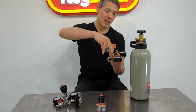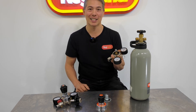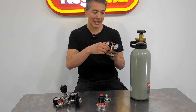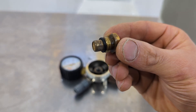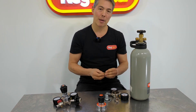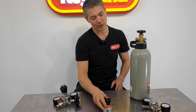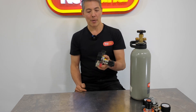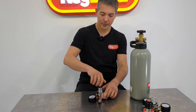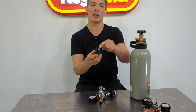You would take the bonnet assembly off like that. This is actually one that has been returned to us — the customer said 'my regulator's not working' — and funnily enough, you open it up and there's corrosion everywhere because liquid got inside. This is unfortunately quite common. Many people don't use check valves. You can see the whole seat and seat cap assembly has quite a lot of corrosion on it. That corrosion caused a pressure creep scenario. With the new Mark 5s there is a much easier way to maintain this — it can be done in the field with no tools whatsoever.